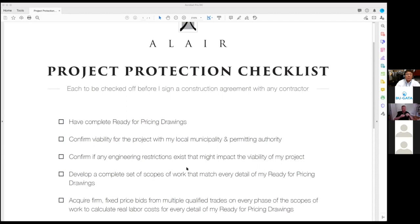If you're thinking about doing an accessory dwelling unit in your backyard, one of the important things to think about for most of your zoning, for R5 and R6 specifically, is that you are limited to a footprint of around 560 square feet. If you are within a foot off of the property line, so you're in the back corner of your backyard, that can be 1.5 stories.